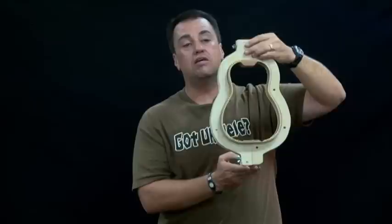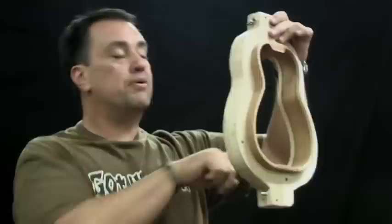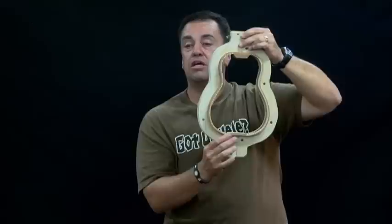Once it's in the final shape we remove the heat source, let it cool back down to room temperature, then release it from the jig and put it into another jig — because initially the wood wants to go back flat, and we want to keep it in its shape. This gives us an opportunity to glue on the blocking, which goes on the inside of the ukulele. These blocks reinforce the area where we did the book match with symmetrical grain, and also help strengthen where we're going to join the neck and body later on.